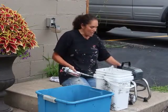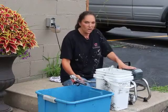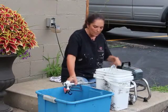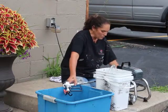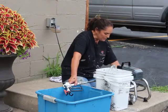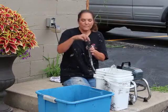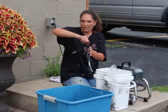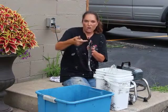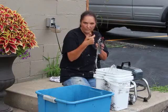Now I want to take it and switch it to prime. I'm going to turn it off and switch it to prime mode, which is going to clean out the hose. I switch the dial to where it says prime and clean. Then I take the on/off switch on our needle and switch it so it's now on off, which is clean — the arrow is now pointing towards me, which means it's not spraying towards the wall.